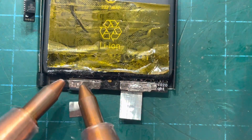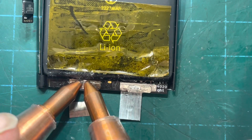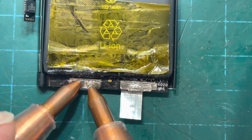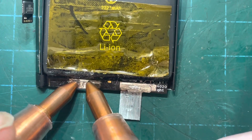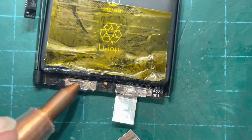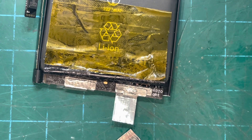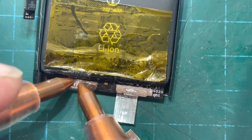I'm going to get these two spot welded first. I want about number six on the spot welder and I need to make sure I've got a good connection. That's that one done. It isn't really penetrating much so I'll go from number six to number seven — that makes a difference. I think it has got it though, it's bit into it.